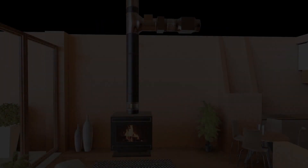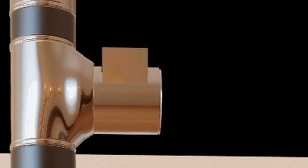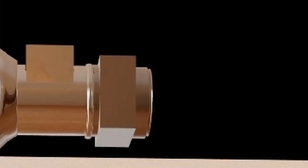The heat control unit is made up of two components. The first is the OHE, which is the overheat exhaust safety component. The OHE provides a safeguard against possible overheating from power outages or malfunctions in the electronics or fan unit. The second component is the control box, which closes to allow the heat exchanger unit to heat to the thermostatically programmed temperature. Once the thermostat senses that the programmed temperature has been met, it triggers the heat distribution unit to switch on, drawing the air through the ducting system.